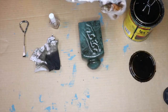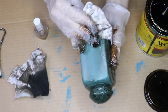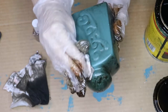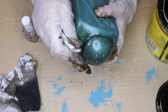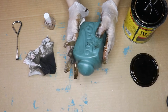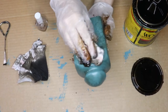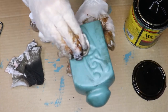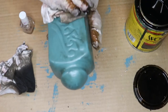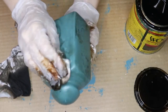Next, grab another piece of cloth and wipe it off at a fairly decent pressure — push kind of hard to get it off. The more you rub, the more stain you will get off, so it's up to you how much you want to take off. You can purposely leave a little bit on, even speckle it a little bit, and then leave it to dry.